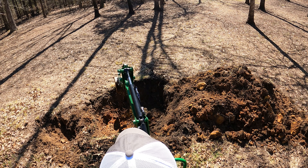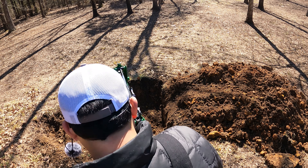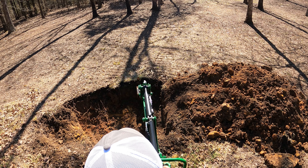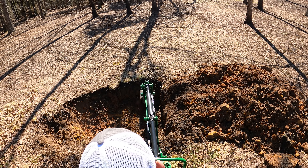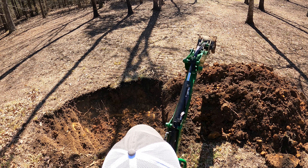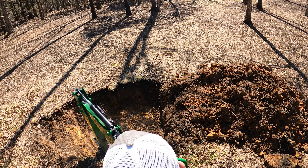I'm going to pull it back to 2000. When I'm out mowing, running wide open doesn't bother me as bad, but sitting still it just sounds like it's being hard on the tractor. Construction equipment — if you go get a mini excavator, even one of the smaller ones, they don't have tachometers. If you look at the specs on a lot of them, they're going to be running 2000 to 2200 RPMs — which you could do all day long in this tractor and get every bit of work that you need done.